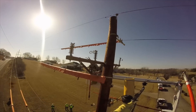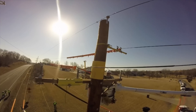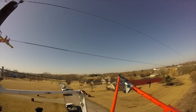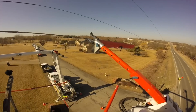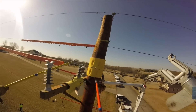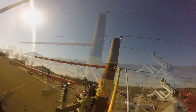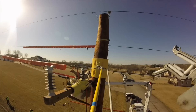They're going to use that jib to lift the line off of its old porcelain insulator, pull it up, and put it on the new insulator — an epoxy insulator on the new cross arm. Then they go back and open up that jib once they've secured the line in its new home. You can see them now putting the finishing touches on the tie wire, securing a solid connection for the new insulator and the live line. There's the hot cutter again, cutting part of that coil off.